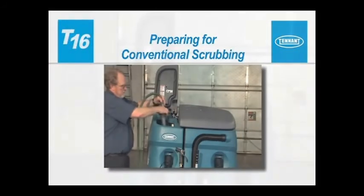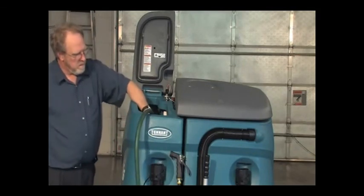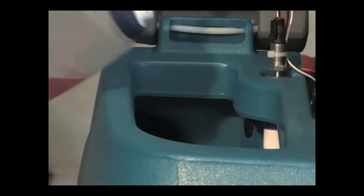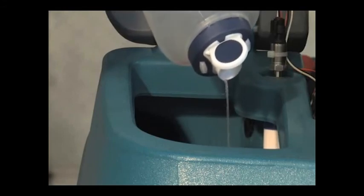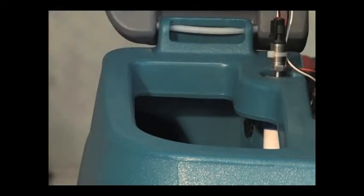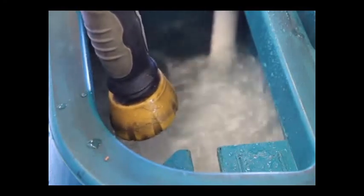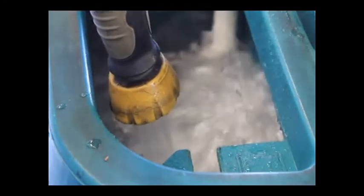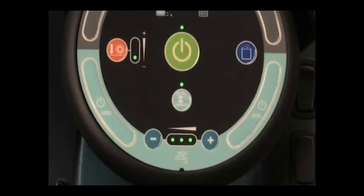Preparing your machine to scrub. Open the solution tank fill cover. Partially fill the solution tank with water, not to exceed 60 degrees centigrade or 140 degrees Fahrenheit. Pour the required amount of detergent into the solution tank. Attention: only use recommended cleaning detergents. Machine damage due to improper detergent usage will void the manufacturer's warranty. Fill the solution tank with water until the level is just below the indicator tab. Flammable materials can cause an explosion or fire — do not use flammable materials in the tanks. Then turn the key switch on, press the large green one-step scrub button and start scrubbing.